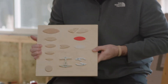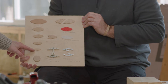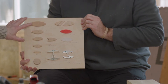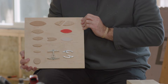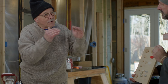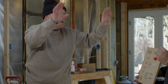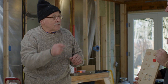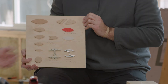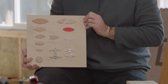If you take a look, we not only have much larger biscuits — the S6 — we have our 20, our 10, and our zero. We have the sub-zero biscuit and the face frame biscuit. You can see we've got them for inside miters. These are just the wooden biscuits, and again, when you break it, it's always cross grain. There's also a clamping biscuit — kind of like a shark where the teeth go backwards. If it's an area you can't get a clamp behind, like a soffit, you'd put in a glue biscuit, then a clamping biscuit.